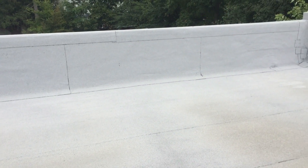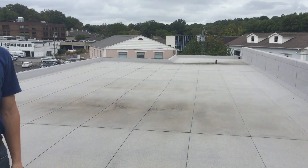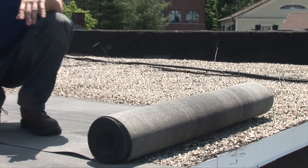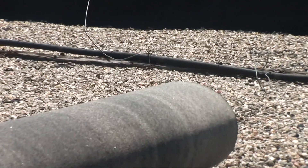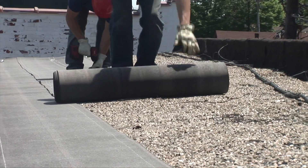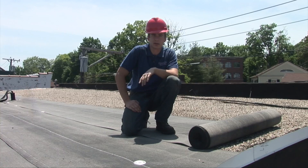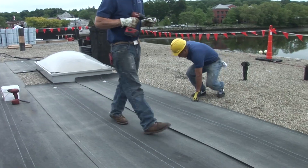I want to show you some good news right now. This roof we did 20 years ago — everything very clean, done with modified bitumen torch-downs, and it's lasted this long and going strong. Also, this two-ply system can be installed over any existing roof or surface with minimal preparation. We re-roofed it and decided to go over rather than strip all the gravel off and the old tar — we save them a lot in cost by going directly over. I started about an hour ago, and this is our fiberglass liner that I'm laying down right now. This is the first step. Next comes the self-adhering base, and then our final layer of modified bitumen torch-down.